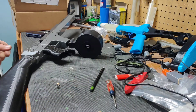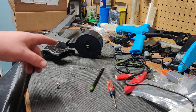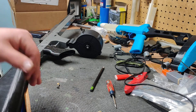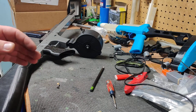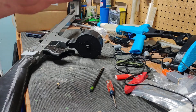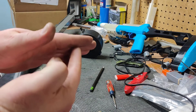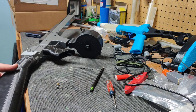We only had two fail that time. The first time I tested it I had loaded it to capacity and had issues - I didn't have anything cleaned up on it yet. So I think what I'm going to end up having to do is take the slide off, weld that lip on the bottom, and then file it so it's square instead of being beveled around the edge. If that doesn't fix it, I'll end up plastic welding some material where the cartridge and the magwell come together to help feed the bullets up so they don't run straight into it.